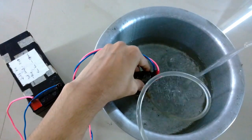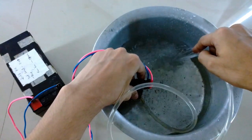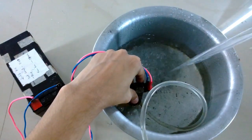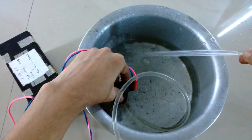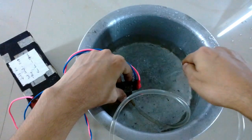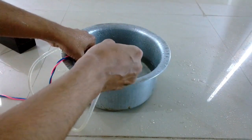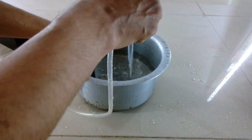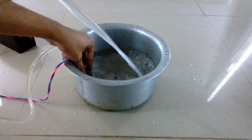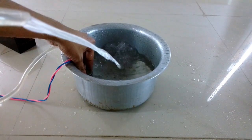When these pumps are fitted into a vehicle's windshield cleaner solution tank, they don't work for very long — only about 20 to 50 seconds at a time. When you press the button it pumps the solution to the spray nozzles, you wipe it, and the total working duration is about 20 to 30 seconds maximum. Here I'm running it for an extensive period and it heats up quite a lot, so this pump cannot be used for purposes where you need to run it for an hour or two.